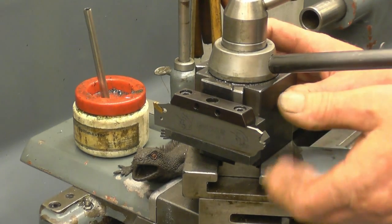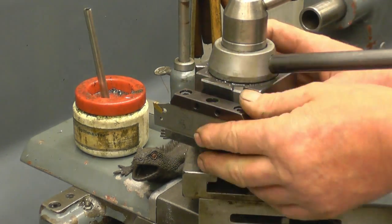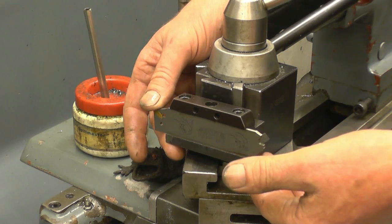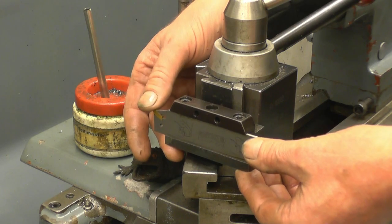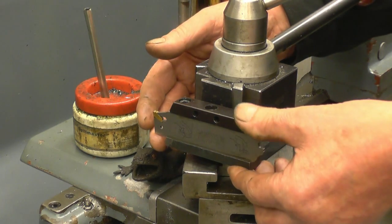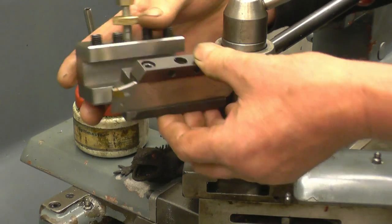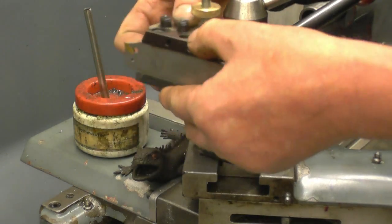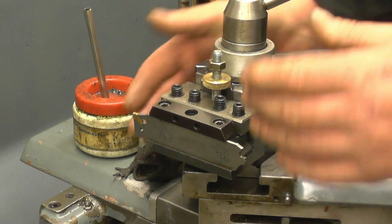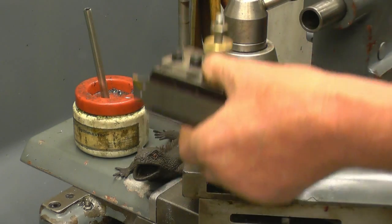I was editing some video last week where I was parting off some materials using this parting tool, taking a fairly heavy cut on some stainless steel, and I noticed that the parting tool actually twisted. Not as much as that, but it moved. Once it does that, it means the tip of the tool goes below center height - that's when you get a dig-in, that's when you start snapping parting tools. Originally when I bought it, it was designed to fit into a tool holder that goes onto the tool post, but the problem was it was sticking out a long way from the center of the tool post and I was getting flex.